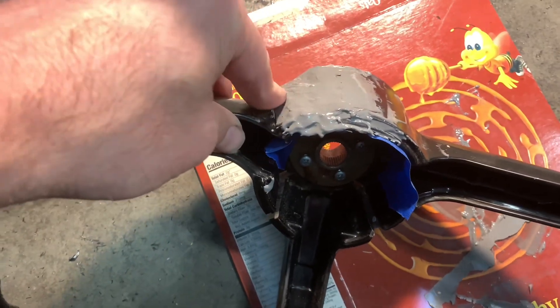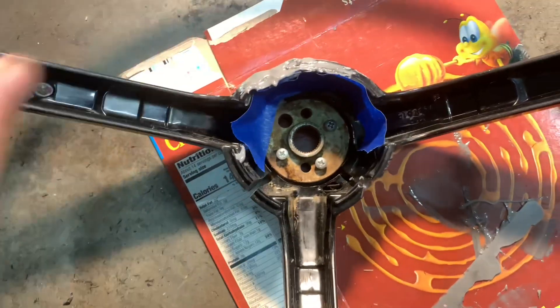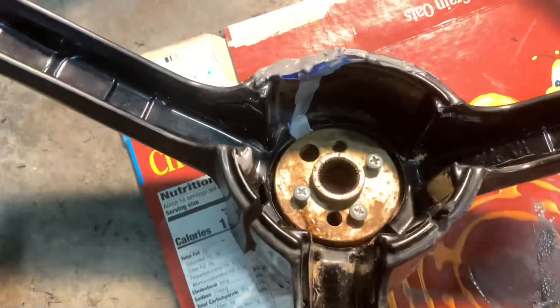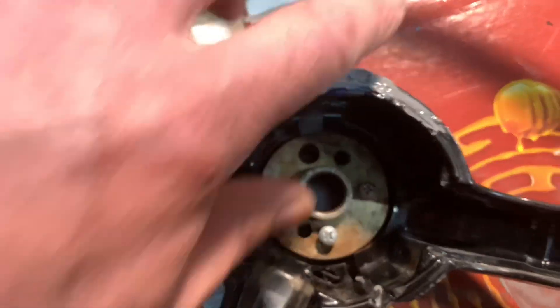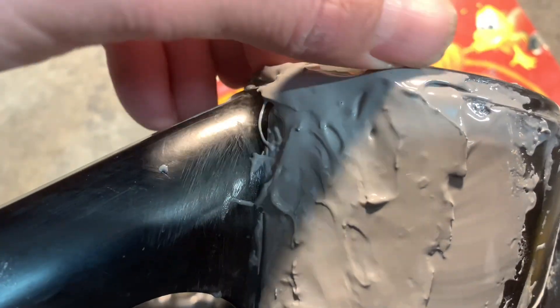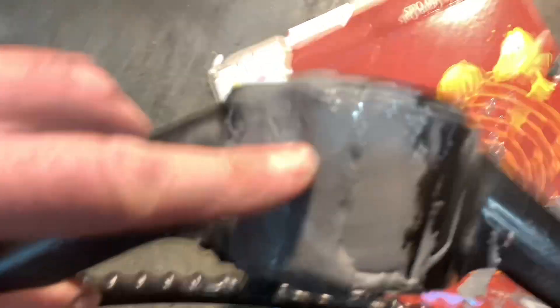We let it cure about 15 minutes here — it's actually dry to the touch, it doesn't seem to be smearing around. It kind of self-levels a little bit, with the viscosity of like JB Weld maybe. Let's peel the tape off. That's pretty cool — the inside looks really good. You just paint that and be done. It actually fills in really nicely, so I think the tape was a good idea. And the outside, well, it's just ugly, simple as that. It's going to take some filing and sanding and some creative work — we've got to cut that groove back into it. But definitely doable, I think this is going to work.